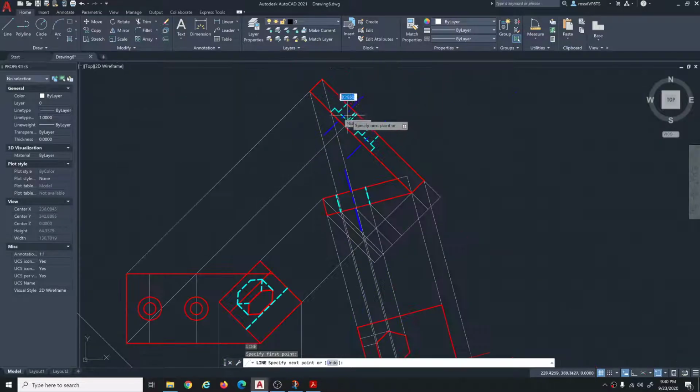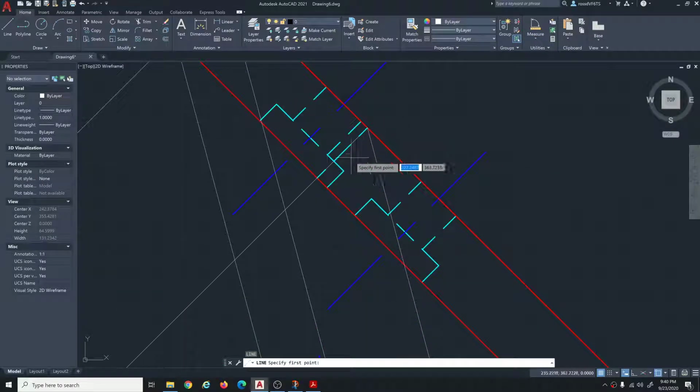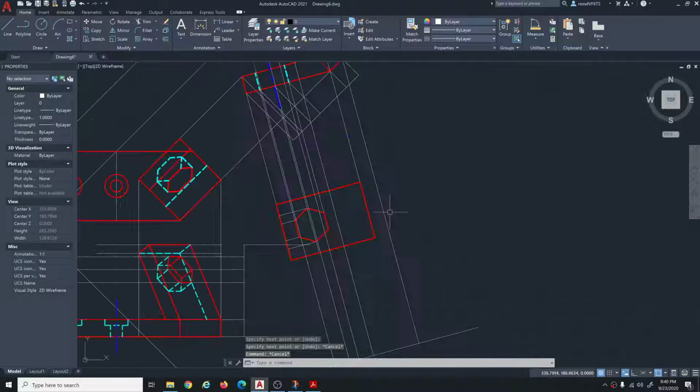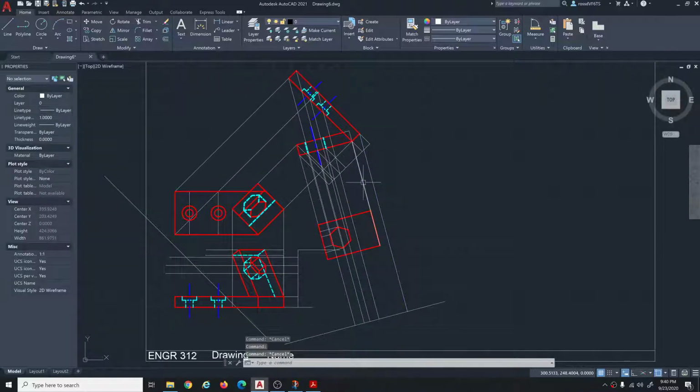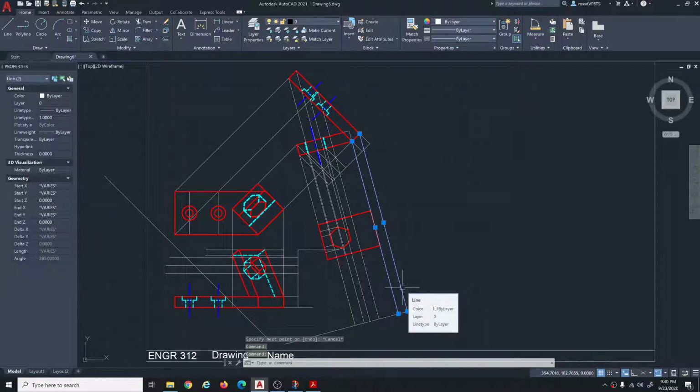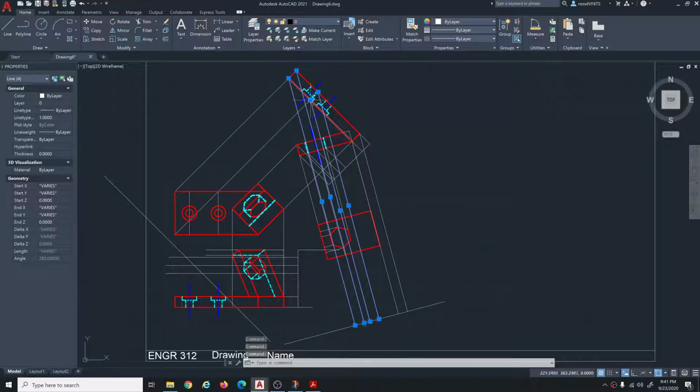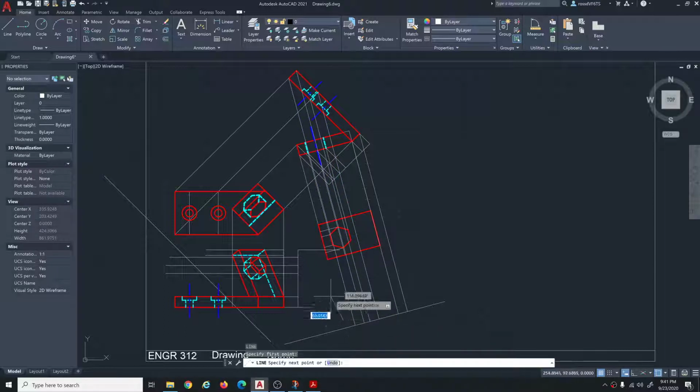So we want to project from this perp and then another line here from there, perp. Okay, so this, we need another one. We need this corner, perp. So these two lines are back in through there, and these two lines are the far back corners. So that's the easiest one to do maybe, is these four lines right here. That's the four back corners, right? The four back corners of this base are on those four lines somewhere, and so we need dimensions in this direction, which we get from two views back.